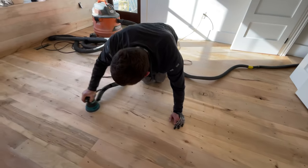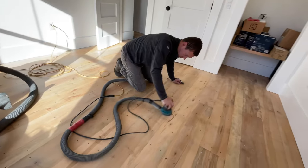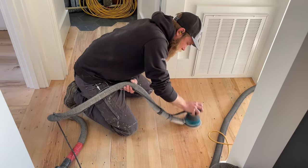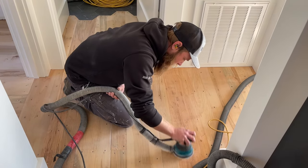Unlike a pre-finished floor where you don't want to touch that finish with any sandpaper or scraper blades — you really just about have to cover the floor completely the minute it's installed. We're going to sand this lightly and put on the final coat. This will be the third and final coat of finish on the floor. We're using the Czar oil-modified polyurethane, and then this should be hard enough to have full traffic on it next week.